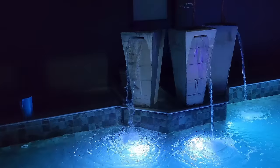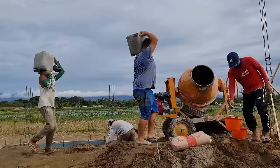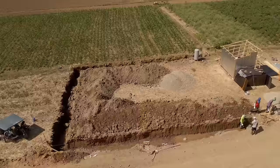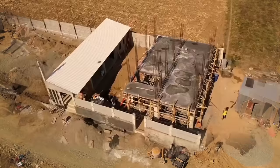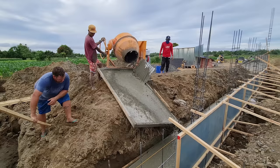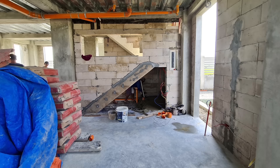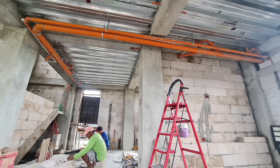Come inside and I'll give you guys a rundown. The house is built on a solid concrete reinforced foundation. Most construction in the Philippines isn't built the same way — we made sure this house could withstand the strongest earthquake and any condition thrown at it. Solid concrete footers, solid concrete stem walls, and then built up with AAC — Stark AAC. If you don't know what AAC is, it's autoclaved aerated concrete. None of these walls are hollow block; they're all AAC, which gives great insulation, soundproofing, and fireproofing.